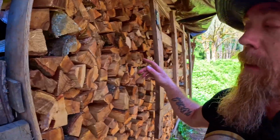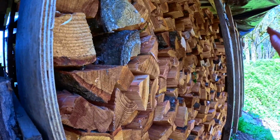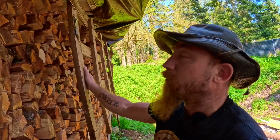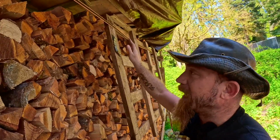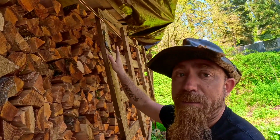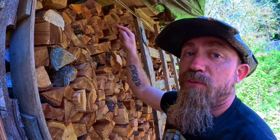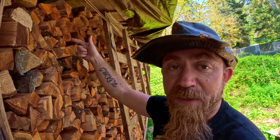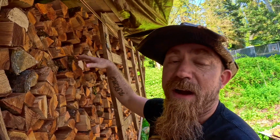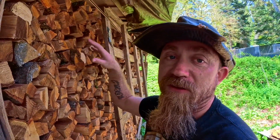So this is now restacked. It's straight and concave inward, so there's less chance of it falling down again. If it does, I have this pallet board suspended with a ratchet strap. So in case it does fall this way, we'll catch this first and hopefully prevent it from falling further. Now I can concave inward because there's no third row in the middle. All that is on this pallet row, there's this one and one on the other side, the cottonwood. Okay, so on purpose there's a hollow gap in the middle for more chance for this wood to dry and dry as fast as possible.